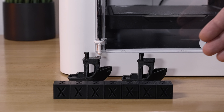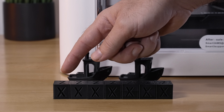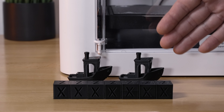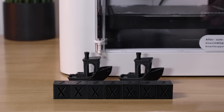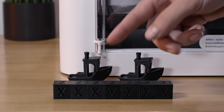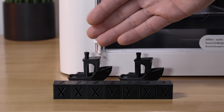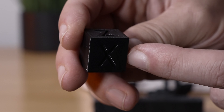We printed quite a few cubes and another benchy to compare, and I was blown away by how well this printer did with speed. We're going from 50 millimeters per second all the way to 500. The benefits diminish as you go up in speed for time saved, but quality was sustained very well, which makes sense as core XY mixed with the resonance shaper puts out great results. This is PLA at 0.2mm layer height.